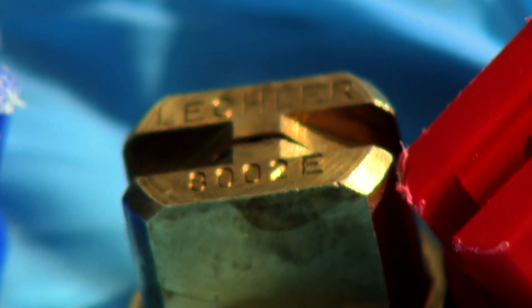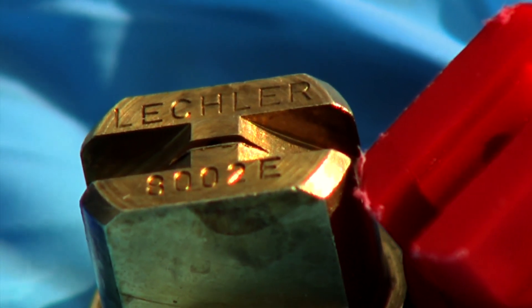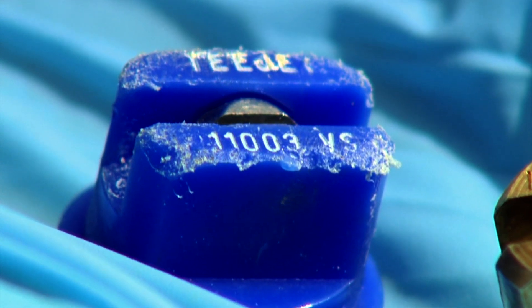A stronger tip, a little bit better, is a brass nozzle. Brass will last a lot longer than plastic, but again will eventually wear out over time. Maybe the best choice is if you can find one with a stainless steel tip. The stainless steel tip will last a lot longer and keep that proper size so that you're spraying the proper output every time that you go out and spray.